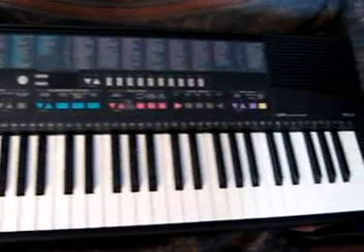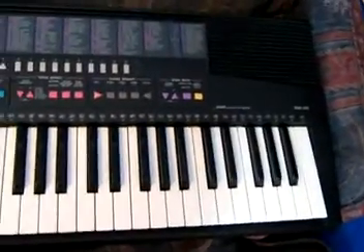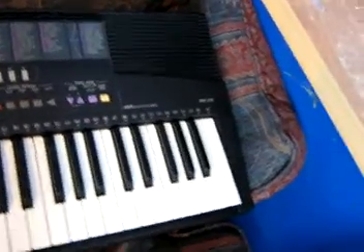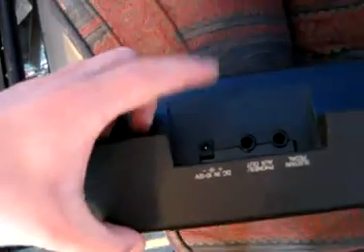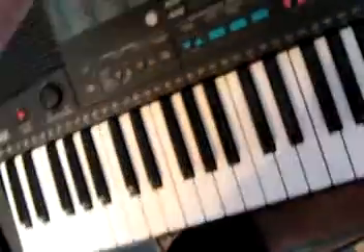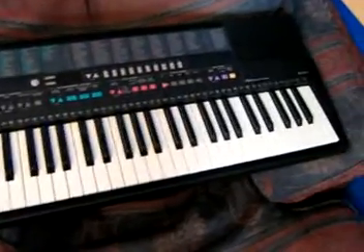As I work in a music shop, I delivered a piano at a customer's house. He had this keyboard that I admired, and he said he was thinking of getting rid of it. So I asked how much he'd do it for, and he said £20. But when I examined it further, I found that this speaker here didn't work. So he said go for a tenner, and I accepted. The reason the speaker didn't work is that he had soldered the adapter wire inside the keyboard in place of the power connection, which made one speaker stop working. The next day I opened up the keyboard, took that wire out, and the speaker was working fine. So I got a bargain there.